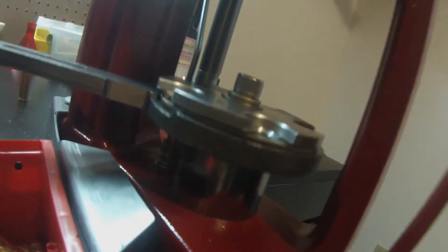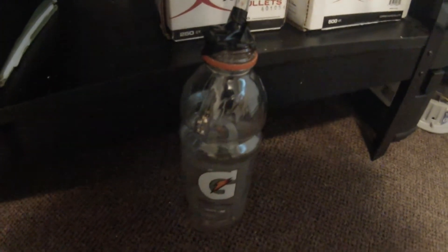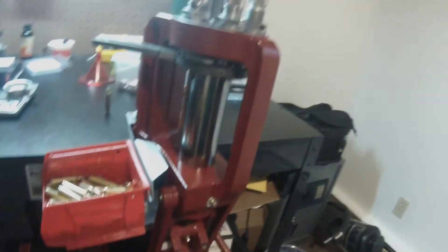Overall it's been working really good. These two fittings down here — little brass head fixtures — are actually for grease guns. If I lift this up you can see the grease underneath there, which makes it run nice and smooth. Back there, that brass tube is the primer drop — so when you knock a primer out it'll fall through there and down into this tube. I have it taped into a Gatorade bottle, so all the spent primers will just collect there until it gets full enough to dump out — just a little tidbit for you.